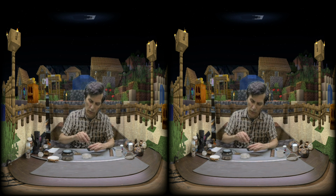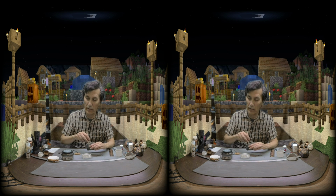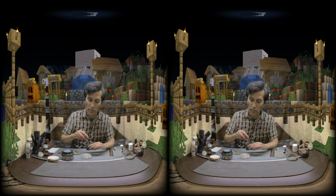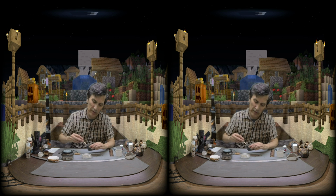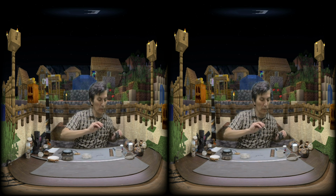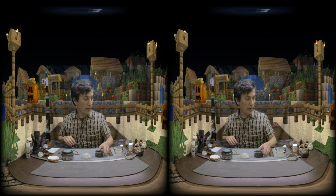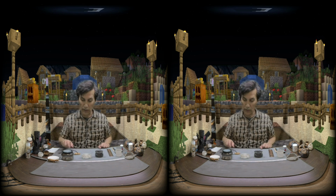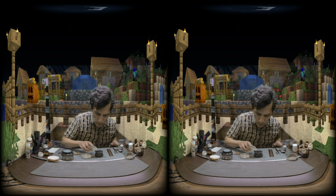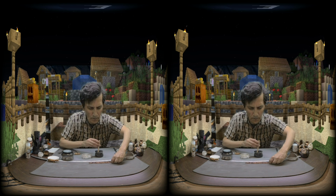However, this paint, I have to say, after years of trying different types of formulations and various sprays, this, as passive and with as high a resistance as this type of conductive paint has, has been by far the most efficient and best paint that I ever used, and it only consists of 3 ingredients: some Modge Podge, some graphite powder, and a little bit of water. I just added a little bit more to thin out.